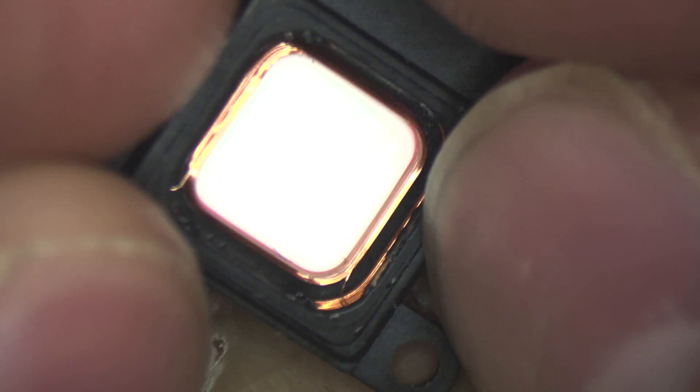Here we go. As you can see, this is the coil that's inside the upper speaker. Now we are going to remove it to show you how thin the jumpers are. As you can see, they are around 0.01 to 0.02 millimeters — very thin, perfect for our job. Now we are going to begin our work and fix this Touch ID. Let's go.